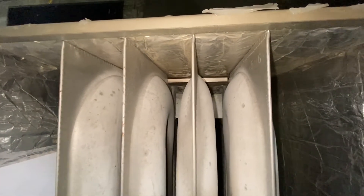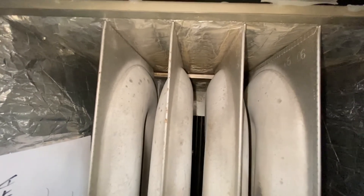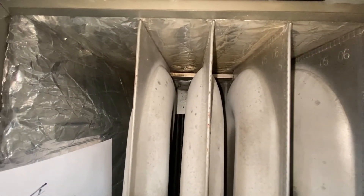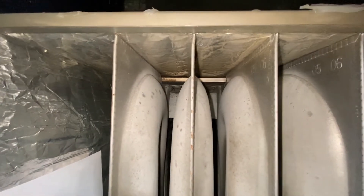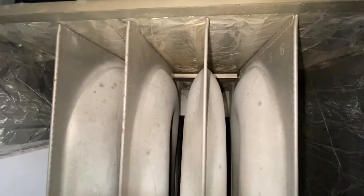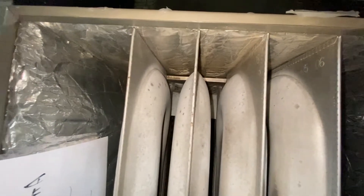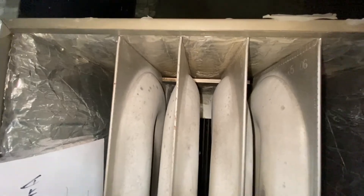If you're suspecting that you have a furnace where the secondary heat exchanger was replaced and it's tripping the high limit but you can't identify why, take a peek down through the primary heat exchanger to see if that plate is there. If it is there, that's not your problem. If it's not, you're going to trip in high fire guaranteed. Hope this video was helpful — take care.